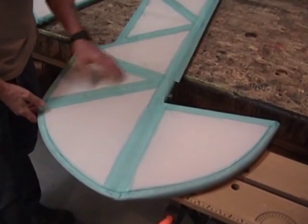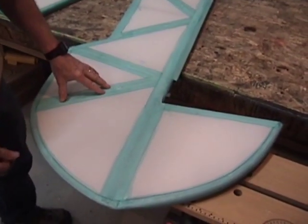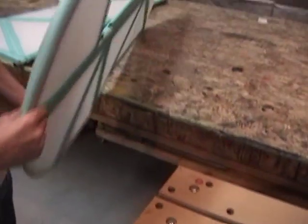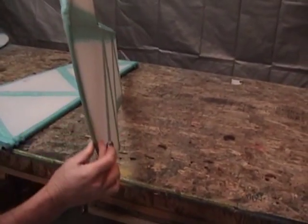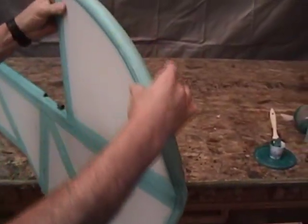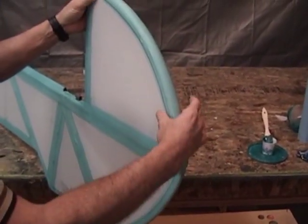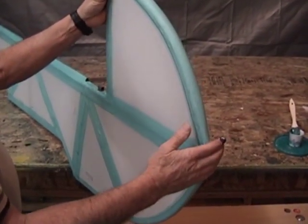Previously on the wing covering, we showed how to lay the flat tapes over the ribs, and we've got that done on these. The main thing now is to demonstrate how to use a non-bias standard tape and how to get a pretty finish around these edges. You notice on this surface we have a fairly wide area here, a large diameter tube, and it transitions into a small diameter tube. So we're going to use 3-inch tape on the wide section and 2-inch on the narrow. We're going to do the 2-inch tape first, let it end about right in here, then the 3-inch tape can come over — it's a little wider — and we'll let it blend into the 2-inch. We'll get a nice transition there.